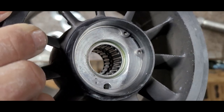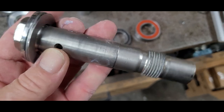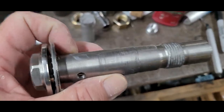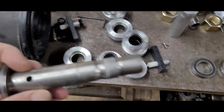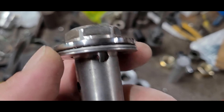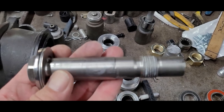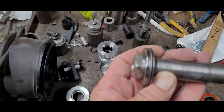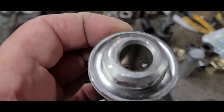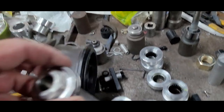I have the front seal out for clarity, as we can see. We have the actual shaft that's been machined smaller diameter for the seal, and the rest of it is turned down exactly the same size all the way down the shaft — except right at the end, where you have the needle thrust bearing. That's what takes all of that axial load. The impeller is trying to pull this axle out, and this thrust bearing handles all of that — it's designed to take those loads.